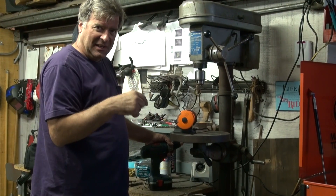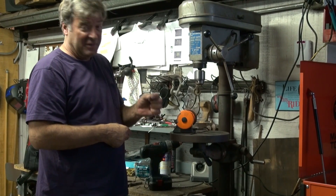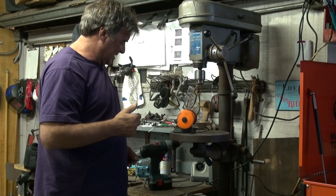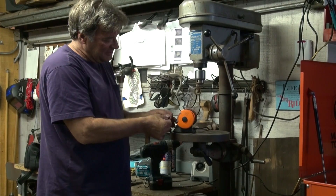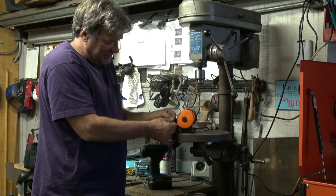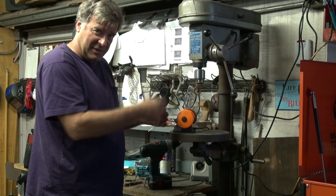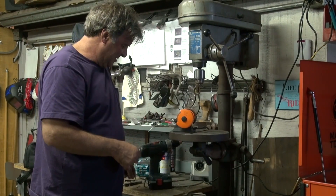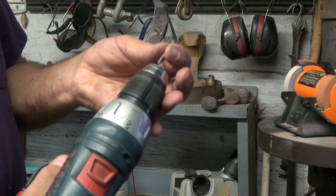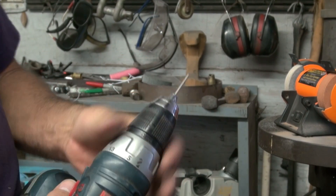Let me cheat a little. Because I'm working with these really short ones, because of the tight area I'm working in on this sculpture. Instead of sitting here trying to twiddle this thing around by hand with my gloves on, so close to that wheel trying to sharpen it — especially because the tungsten gets hot so quick, it transfers the heat. So I put it in the drill, chuck it into the chuck, put it on slow speed. You don't need 8,000 RPM on there.